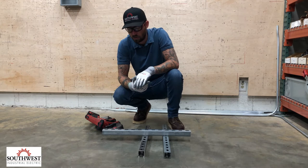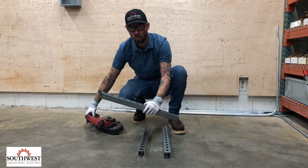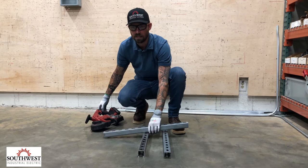The general setup when cutting something with a bandsaw, whether it be pipe or strut, is to make sure wherever you are in the field that the material is set up and supported by something — you should not be doing the supporting yourself. You don't want to be holding a piece of strut freehand and trying to cut with the other hand. It's just not safe because things move around and it's not predictable.